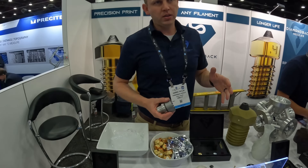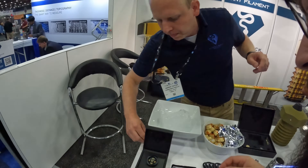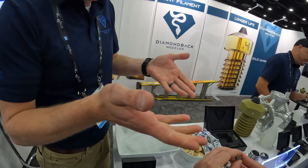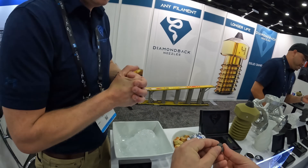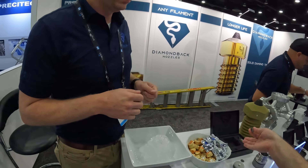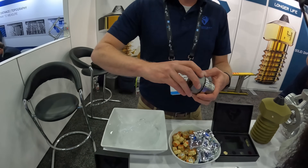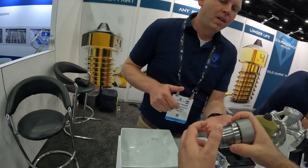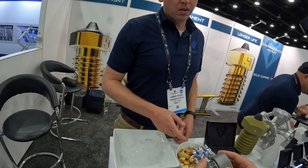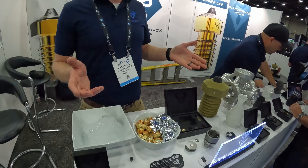We've been in the diamond business for over 40 years. Here's one example — this is tungsten carbide base with diamond on top; it's typically used for oil drilling cutters. Same type of diamond as in the nozzles. Here's another application: a diamond-on-diamond bearing. The coefficient of friction is better than Teflon, and you don't need to lubricate it at all — it's open, not sealed. There was one application where they were wearing out their bearings, put one of these in, and it's been running for nine years now with no maintenance.